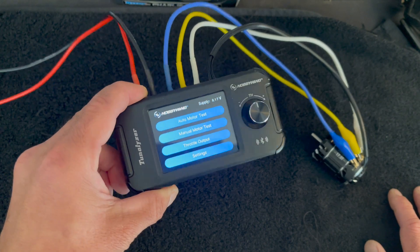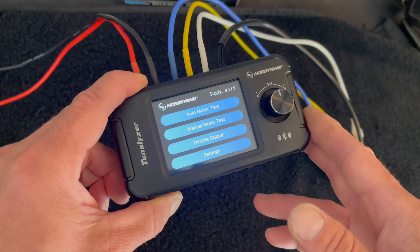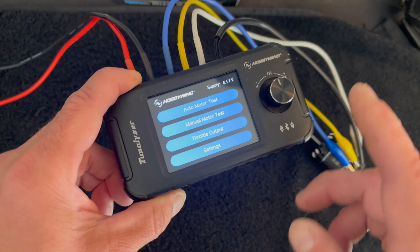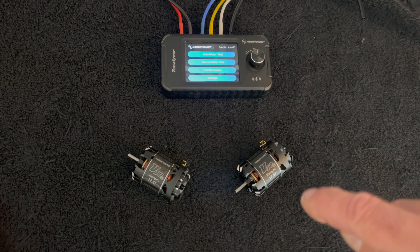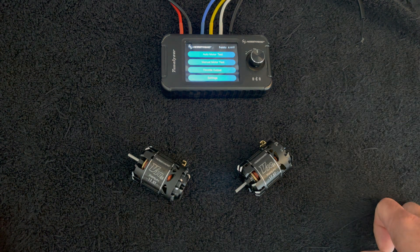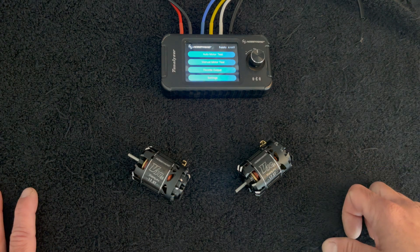It can also test sensorless motors — if you want to do sensorless motor testing, it works without the sensor wire, you just don't get the sensor information. It does NOT work with brush motors, sorry. And it doesn't have to be a Hobbywing motor — it will run pretty much any modern brushless motor. It takes 2S to 4S input but outputs at 1S or 2S. If you have any questions, comments, or concerns, feel free to shoot us an email at northamerica@hobbywing.com. Don't forget we also do a podcast called RC Stuff Powered by Hobbywing — new episodes on the first and third Friday each month. Thanks for tuning in to another episode of The Charlie Show, new every Tuesday right here on the Hobbywing Official YouTube channel!